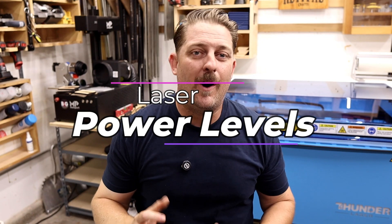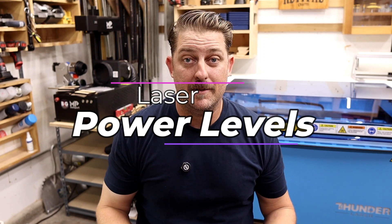Power levels are also going to come into play during our test cuts. As a business owner I try to cut or engrave at the highest possible speeds — it's crucial for us to get products produced fast. For that reason I'll be pushing the power percentages very high, even up to 100%. The Bolt Pro and other Thunder Lasers are able to run at these high power levels safely and efficiently. That's one of the great benefits of having an RF tube, which also gives you the ability to change the frequency output of the laser between 1 and 25 kilohertz.